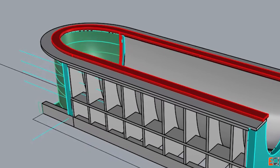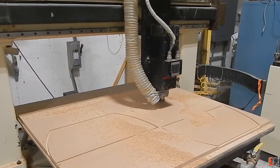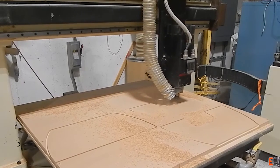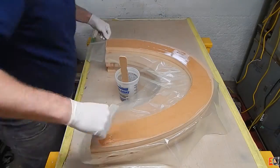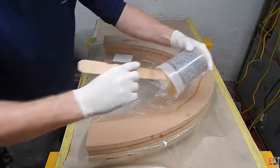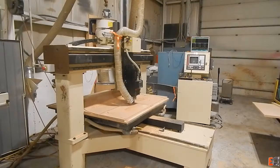Then we're going to work on the 3D machined parts in green on the nose of the shell. First, these pieces — the layers of the blocks — are going to be cut out just to save material and eliminate some roughing further down the road when we go to machine the final surfaces. Here they are getting glued up and vacuum bagged. Having them pre-cut makes this a lot easier and saves gluing up a giant block and then machining most of it away. Here are some other ones, and one of the bulkhead blocks for the pieces in front and behind the strip planking to form transverse sections.